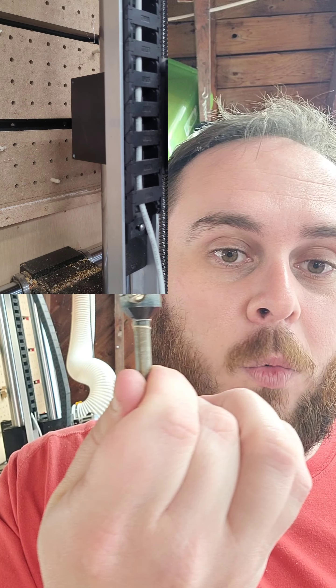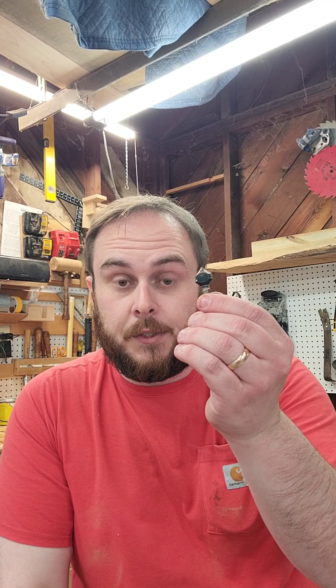I'll do a little diagram up here that kind of shows you what it looks like as it's going through — it's doing a 45 on each side. There are a couple different avenues you can take. You need to do a profile pass where you basically just draw a line, set the depth of your bit to that level, and have it move through the material. That's great as long as your bit's big enough and your CNC can handle plowing through that much wood at one time.